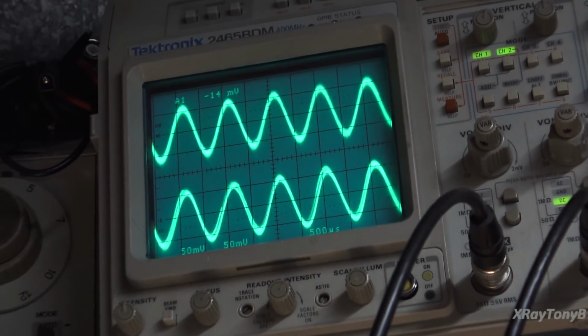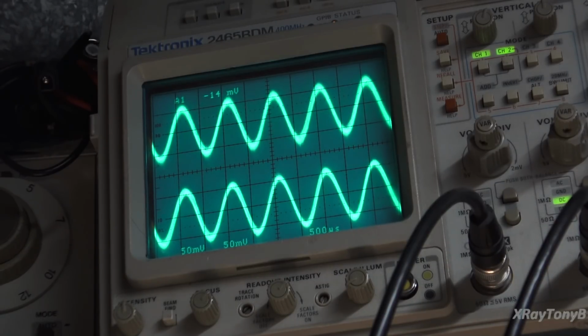Okay, let me get my microphone a little bit better here. What you're looking at right now is an oscilloscope waveform of the speaker outputs across the dummy load of the amplifier. Now we have the second channel all finished and rebuilt. It's good as new now. Everything's perfect, and all the output transistors have been replaced. And I did everything to channel 2 except bias and DC offset. So one of those channels is the one that's perfectly aligned and everything's perfect on it.